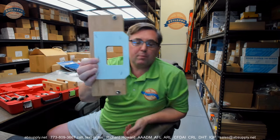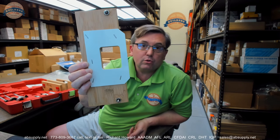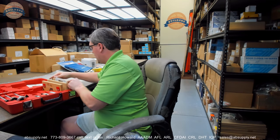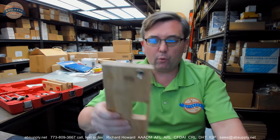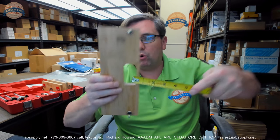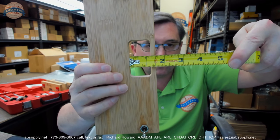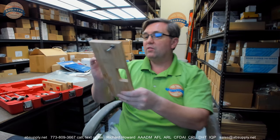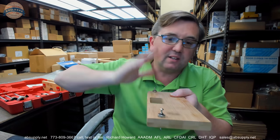You're going to have a full lip strike. This would be a full lip, a 2 1/4 tall D strike or a full lip strike. That's going to be your 1 1/8 wide. This should be 1 1/4 wide. Yep, spot on. Okay, so these templates, obviously what you do is get that on the edge of the door and nail it down.